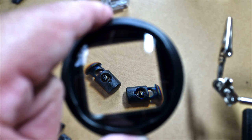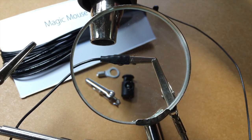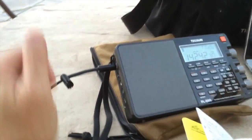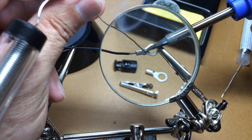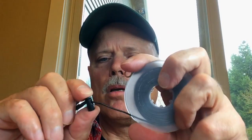On one end there is a small mini cord lock and an alligator clip. I go through the effort of putting a little heat shrink tubing on all of these antennas on any of the exposed parts, just to make it more comfortable in hand. The purpose of the mini cord lock is to act as a strain relief, and you can slide it anywhere you want on the length of antenna wire. Perhaps you want a tail of two feet of loose wire that you can then use the alligator clip to attach to the antenna on your shortwave radio. On the other end is an eyelet loop that is soldered in place and then covered in heat shrink tubing. That's a place where you might want to secure your tether cord — hook it up to a flag pole, a fence post, whatever — and then use the cord lock to act as a strain relief.